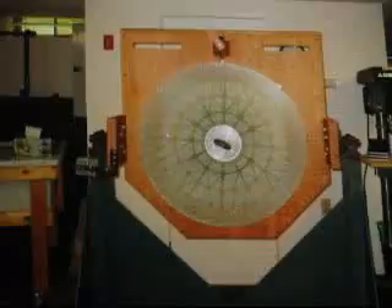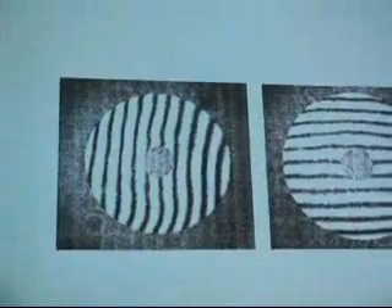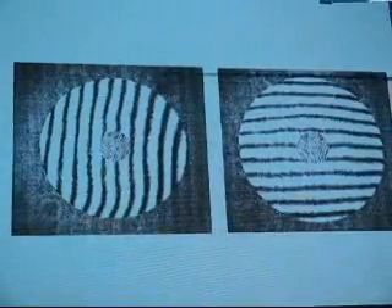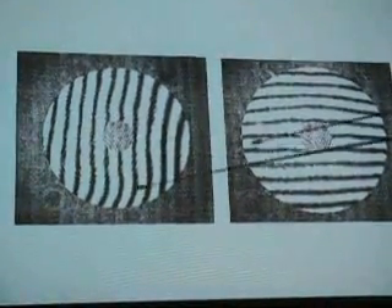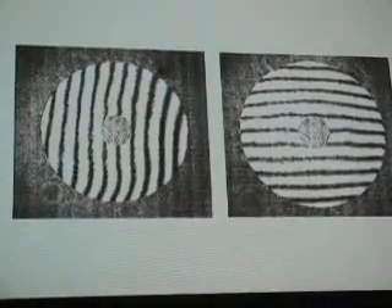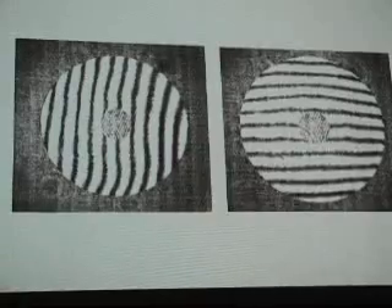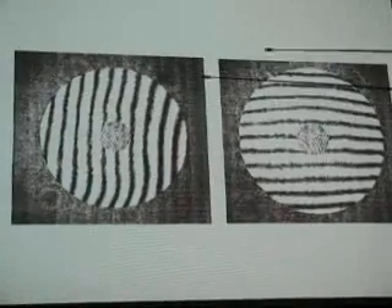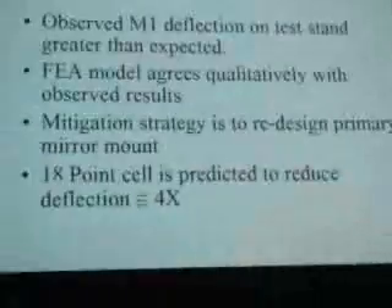Pressing, polishing, and the mirror is being tested on a big flip table. We look through it and I said, 'Oh no' — it looked like a turned edge. But it turned out it wasn't, because as we rotated it, it always stayed aligned with the gravity vector. It turns out my friend George — a very knowledgeable guy — and Scott spent about a month doing a 10,000-element finite element analysis on the mirror and recreated the deflection simply from gravity. This is sort of like the Hubble story: the mirror was ground to 1/16-wave but had a third-wave deflection due to gravity, so it wasn't really 1/16-wave.